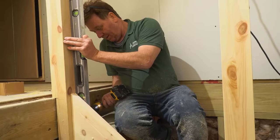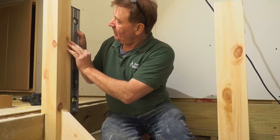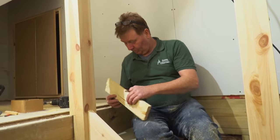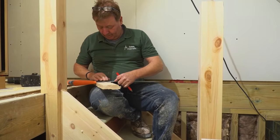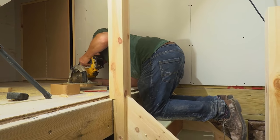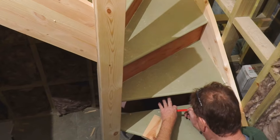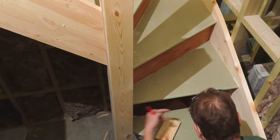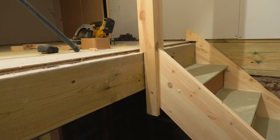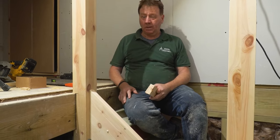It's in one piece, so when you take something like that kite, which is quite big, if you did that in softwood, you would be doing it with stuff glued up out of several pieces. How wide would that be? You wouldn't get it, 500-600 mil to start with. So you've got a choice of putting several bits of softwood in there, glued up, which could shrink and crack and creak. It's either that or ply, I suppose. Ply's a bit of a problem, because then you've got to nose it off. How thick is that MDF? 25 mil. So it's 25 mil MDF.